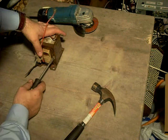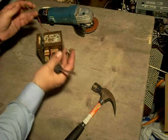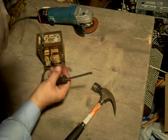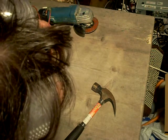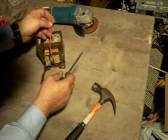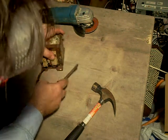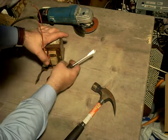I do know but I can't be bothered to go into it quite frankly — it's not relevant. The filament winding is the main thing, and the filament is connected to one side which is connected to the DC side of the high voltage circuit, which means it needs to be well insulated and is indeed packed in with the high voltage and separated by a gap from the mains primary side. It's insulated with heat resistant wire. This is the 2000 volt or 2100 volt, depending on the model of microwave, secondary winding. One side is clamped to earth or ground here.